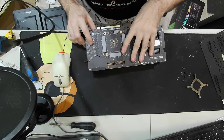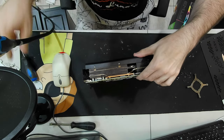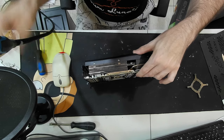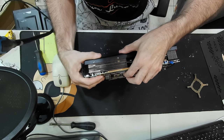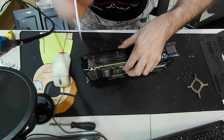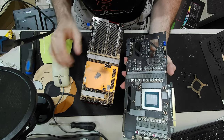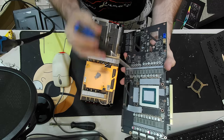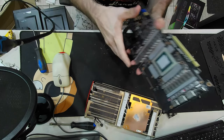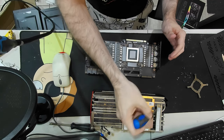Mistake - before you put it back together, you always want to check the thickness of the pads you just put in. This pad here is really thick and the stock one over here isn't touching anymore, even if I apply force as if I'm screwing it down. The pad is too thick. I gotta go back and replace these ones with 1mm thick pads - don't use 2mm thick; it's not the same as the XC3. Two millimeters is too thick for this one - it didn't even touch the die. Always double check your work. I'm gonna cut out new 1mm thick pads for the chokes.